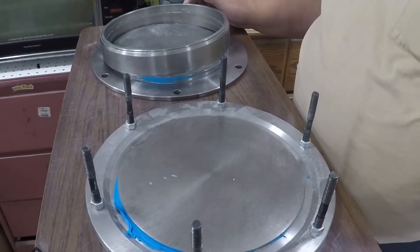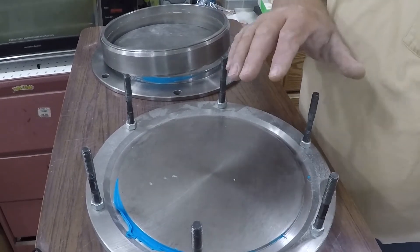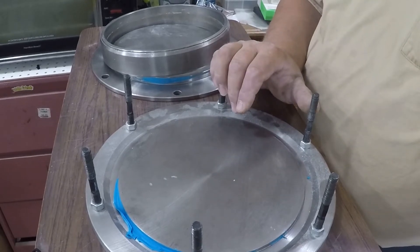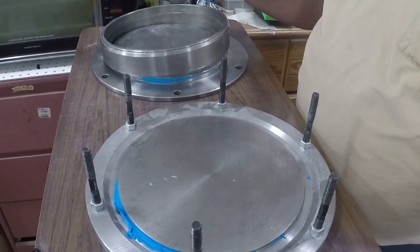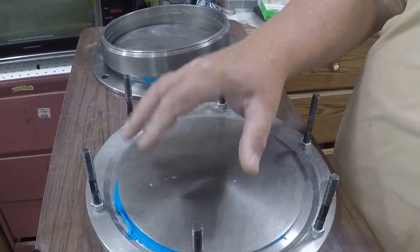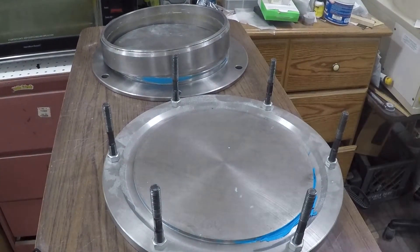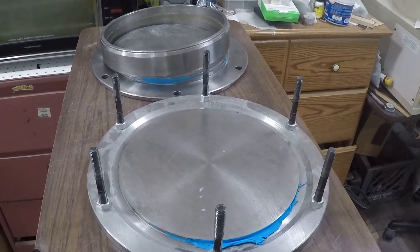We're back for another segment. I actually cut the molds last night - I put the gates in last night, the kiss gate and the run, on size sixteenth. Today I'm going to be showing you how I mold them and my mold frame. This is my mold frame - it's still dirty from yesterday from the silicone mold. We're going to clean it up real quick, get it ready for the silicone, and I'll go through the steps on that for you.